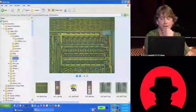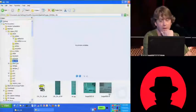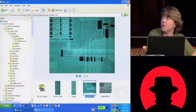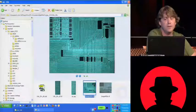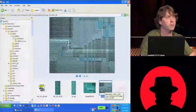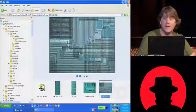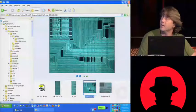I'm going to speed up, guys, because I've got like 8 minutes, and so I'm going to skip a couple things. Before we spoke about dark field, here's the corner of that boot ROM in that 8051 from 1983. That's dark field. Here's bright field on the same microscope. So just flick a switch and it switches the mode. So bright field, you can't really read the ROM. You can't really see the bits. Switch to dark field, boom, now you can see them clear as day.